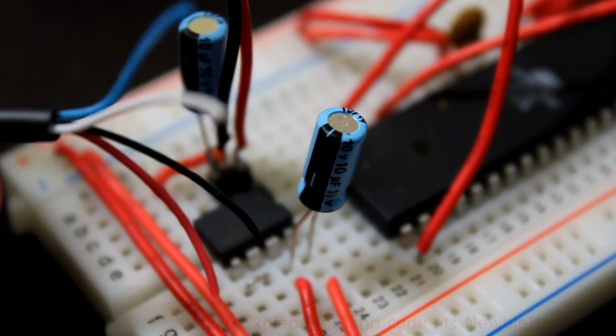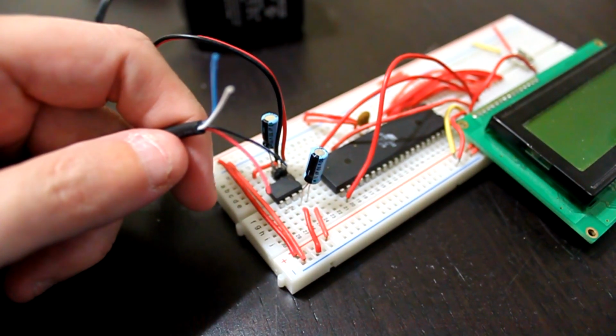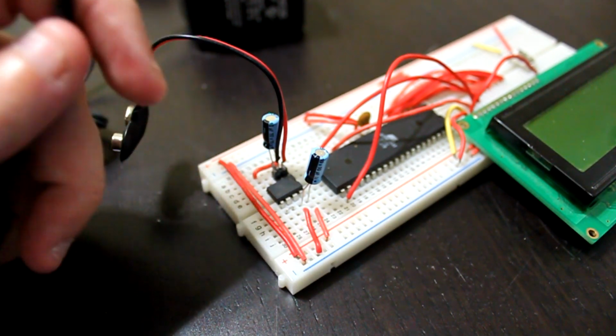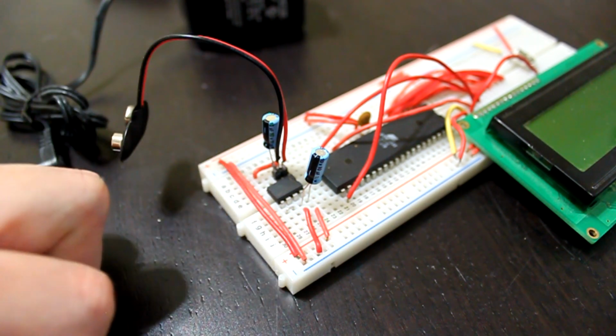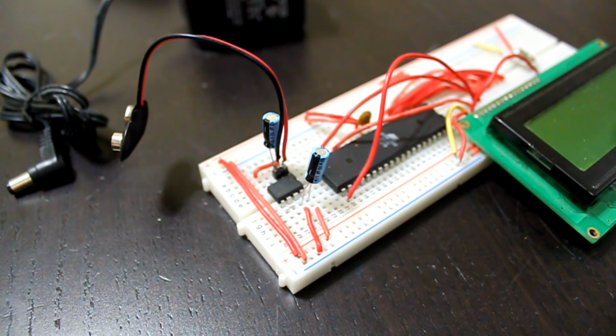So those are the options of using different power sources for your circuits in microcontroller circuits and design. I've given you options for using battery, wall adapter, and computer, and shown you different ways you can put batteries to the circuit, powering the microcontroller using 2 different types of voltage regulation, one for low dropout and one for high dropout voltages, and the proper ways to connect these voltage regulators to the circuit. Thank you for watching.